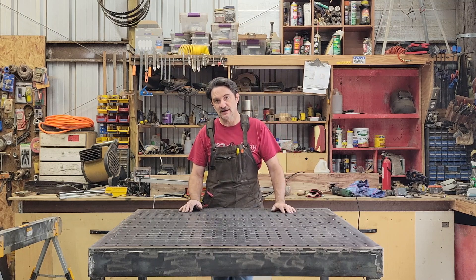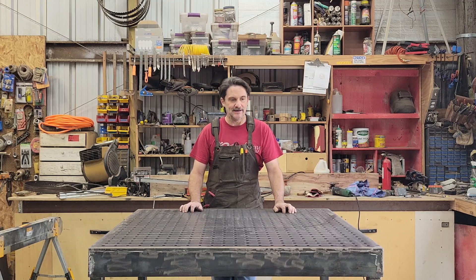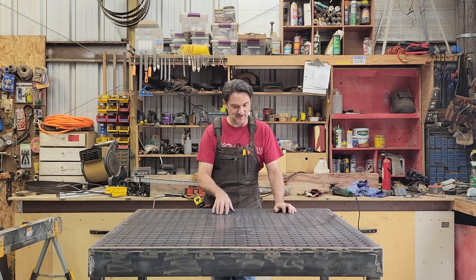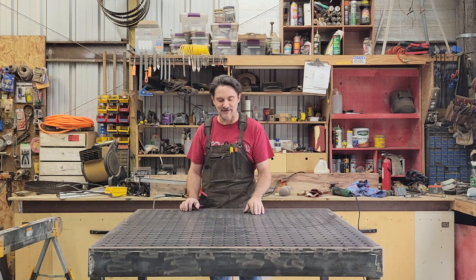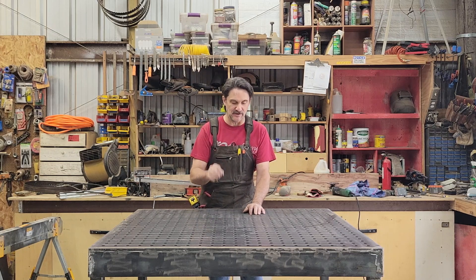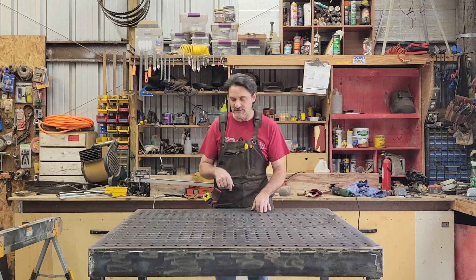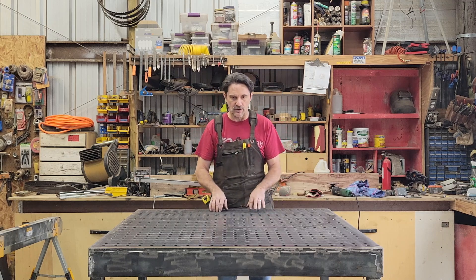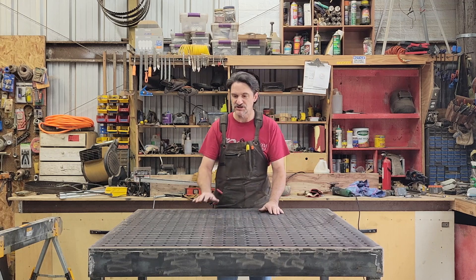My local metal company actually has a CNC plasma cutter which we used. A couple of things that I learned: the holes are pretty much the size I need them to be. Five-eighths is 0.625 and I had these drilled out at 0.635, so it's a little bit bigger. The plasma cutter doesn't quite get all of them perfectly round, so I'm going to have to go and take a little tool and clean them up a bit, but overall most of them are pretty good — you just have to clean up a little bit of the slag left over.